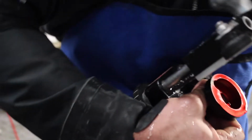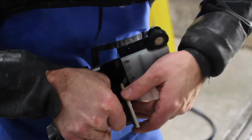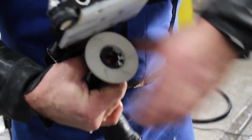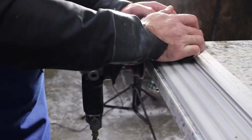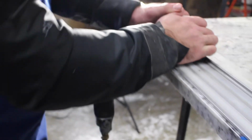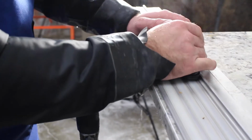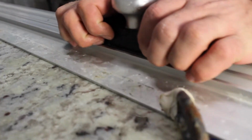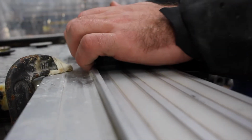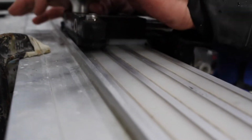When using the turbos to dress the seam, the technique for holding your seam phantom is a little different. Keep both hands on the top of the seam phantom while pushing down to keep the turbo running flat, and forward to keep it running straight against the glide guide. This fabricator prefers to keep his fingers on the ridge of the glide guide in order to pull the seam phantom tight to the back of it. This helps avoid flexing or bending the glide guide.